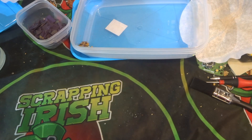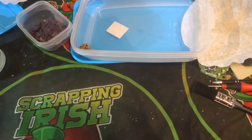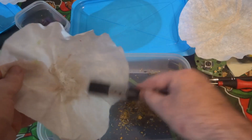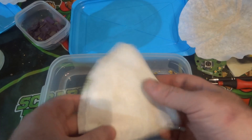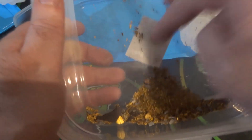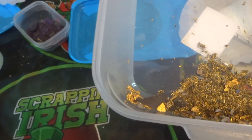We still have this other filter to deal with - we've got these foils here, so I'm going to let that dry and add that to the rest. I think that'll be nearly it for this video, because the next stage will be the aqua regia stage and the drop. I'll put the aqua regia and the drop together for the next part. The thing I've noticed is a lot of these are still magnetic, so I may put them back into another bath of HCl nitric to dissolve the pins first. Let me show you with the magnet - you can see the way the magnet has stuck to the bottom of that. There's a lot of metal in there that needs to be got rid of first.